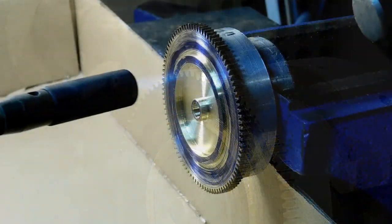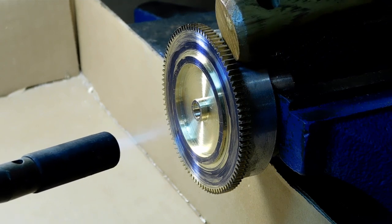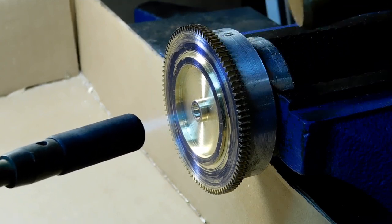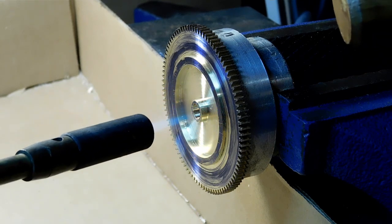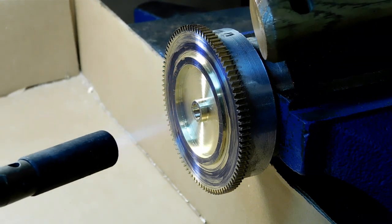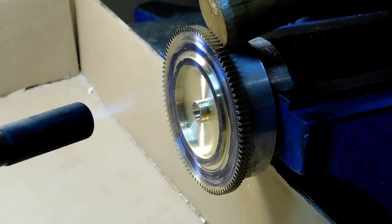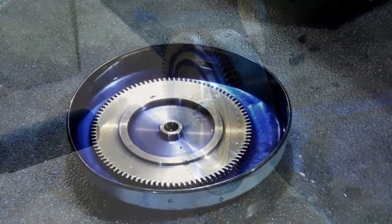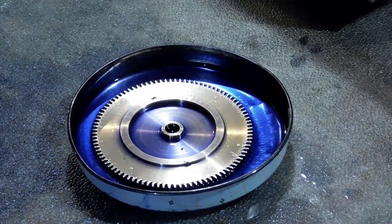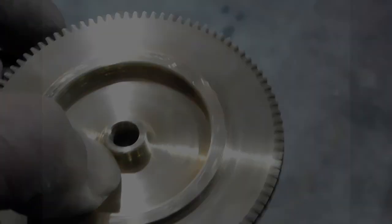All done — I've got the propane torch on there because it's on pretty good. I'm using the wooden end of my hammer to coax it off. There it goes. Now it's in some lacquer thinner to get the Dykem and all the super glue off, and once again it's on the piece of glass with sandpaper. There's the finished wheel — now we're ready to make the click.